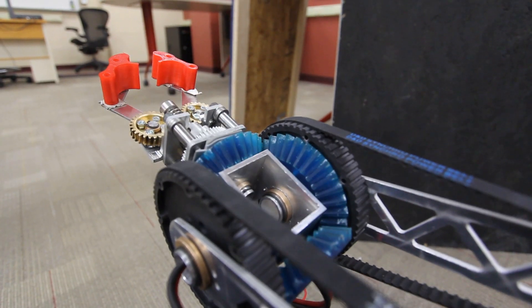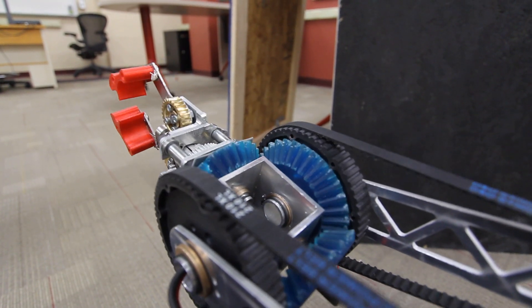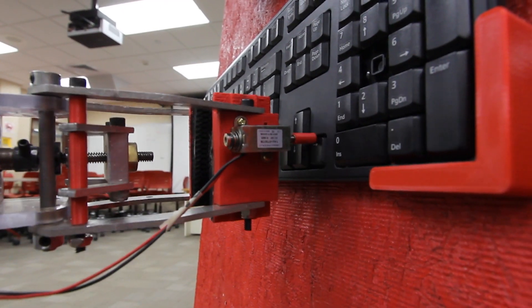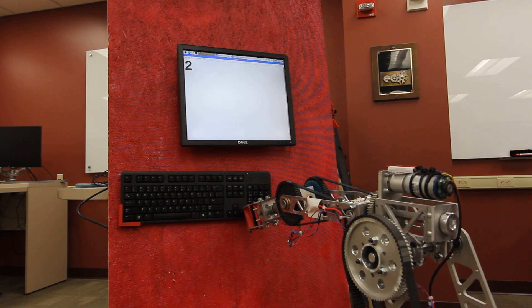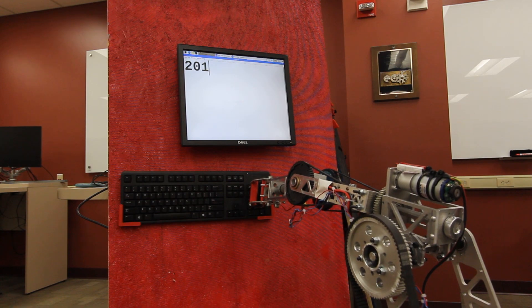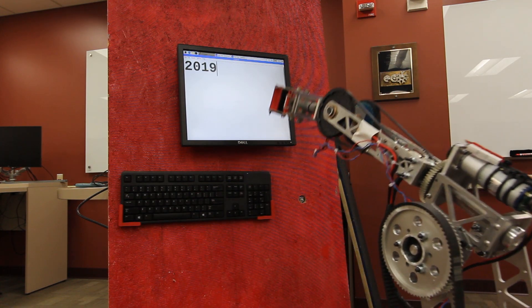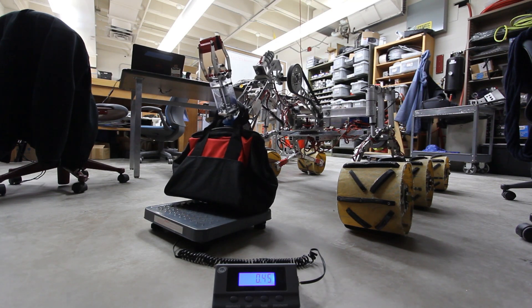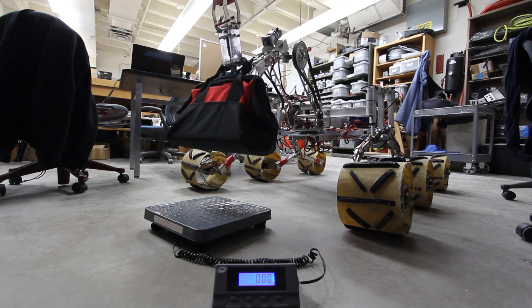With a clamp style manipulator made compact using a worm gear drive, the arm is more than capable of deft, accurate manipulation. The grip's elastomer material is compressible so that it will securely grasp items of various shapes. The wrist is able to rotate 180 degrees and we are prototyping systems to attach to the opposite face for specific tasks such as the screwdriver.